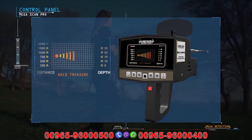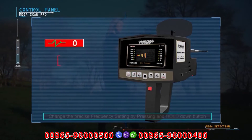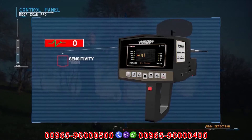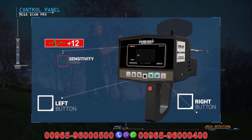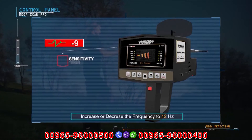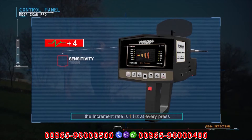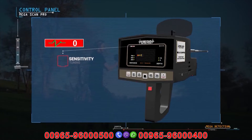You can switch between distances and depths using the up and down buttons. To change the precise frequency setting, press and hold the down button until hearing a different tone, then change the value with the right and left buttons — the user can increase or decrease the frequency up to 12 Hz, with an increment rate of 1 Hz per press. It is preferable to leave the precise frequency on the factory default at zero.